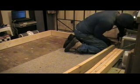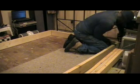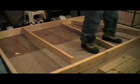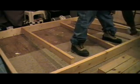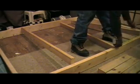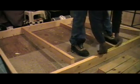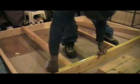I'm using 3 inch deck screws to put this frame together. Remember the key is to put your 78.5 inch 2x6 in between the 2x6s you have cut at 60 inches. I'm just marking 16 inch centers for the placement of my 2x4s.